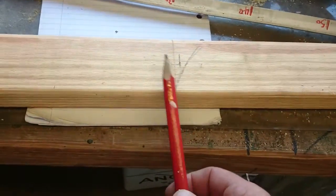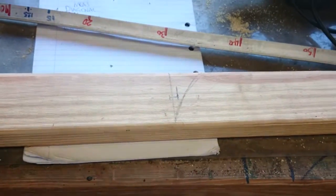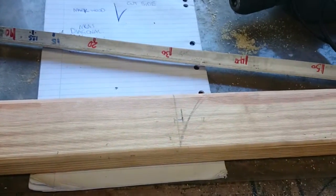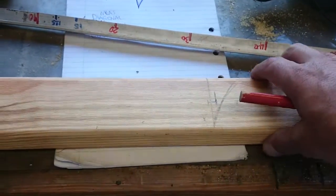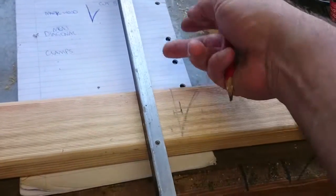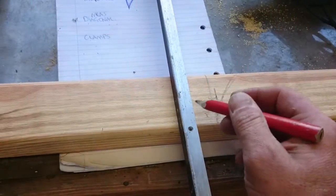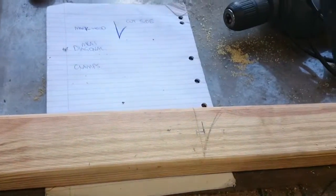If you're going to use a circular saw to cut your framing instead of a drop or miter saw, you've got to be really careful. I've never been very good at cutting straight lines with circular saws — it's very easy for them to wiggle and you'll end up with material cut incorrectly. You might be able to make yourself a jig: a piece of material screwed down to the bench with a piece of framing wood and a little pad, so you can clamp your wood and run the circular saw down the edge of the guide.